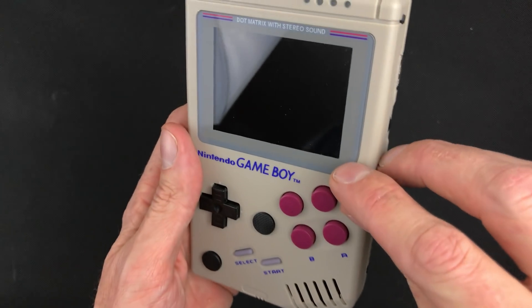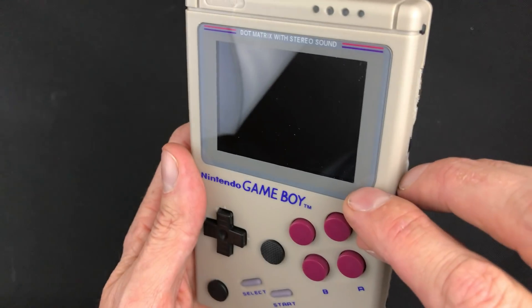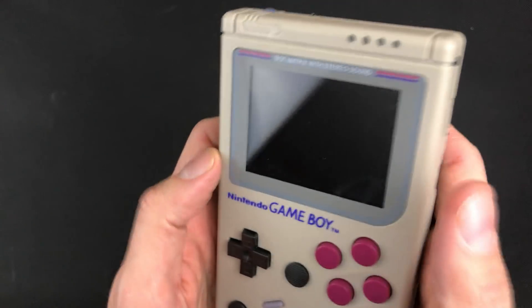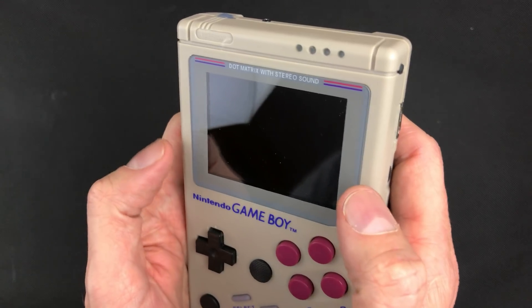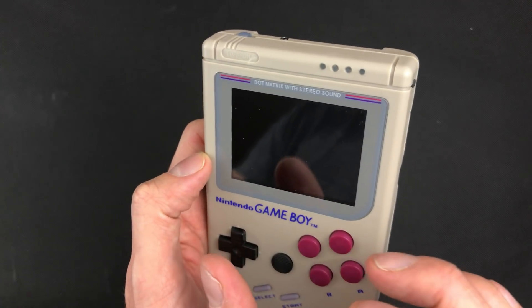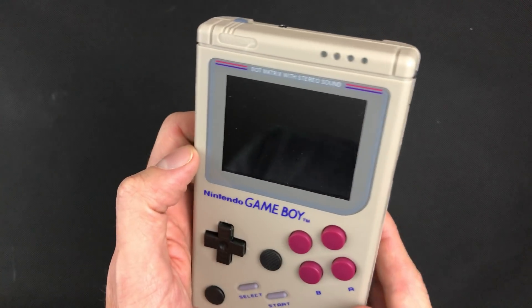I ended up damaging the screen just a little bit — 16 lines from the bottom I had to overscan out. That's why I had to thicken up this bezel a little bit. And I brought in the sides so I can keep the aspect ratio looking a bit better instead of stretching or having black lines or anything like that.